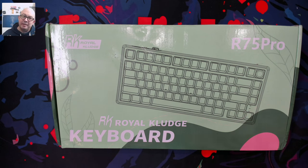Also planning, and this is probably a little bit down the line, but I'm gonna take a pre-made keyboard, use an MCU, and rewire it, or basically turn it into an open source keyboard. The only thing that I won't have control over is the LEDs, which I don't think is going to be that big of a thing, because I'm just going to set them to one color and then forget it. Then I'm going to wire an MCU to an existing PCB and use that MCU to control the keyboard and all of the layers and everything but the LEDs. So that's one of the many videos that I have in the works.